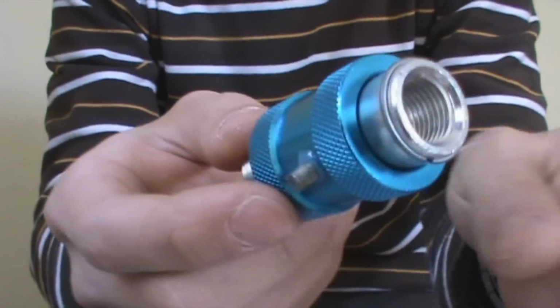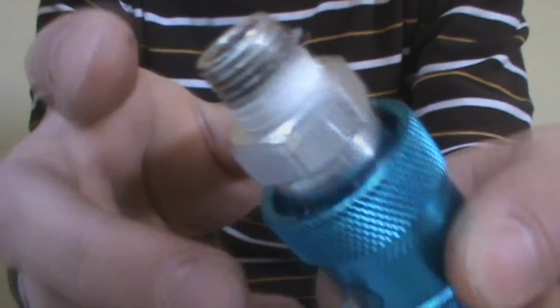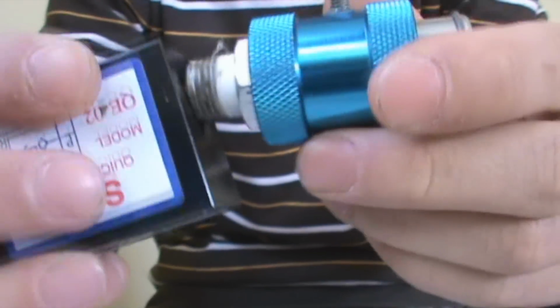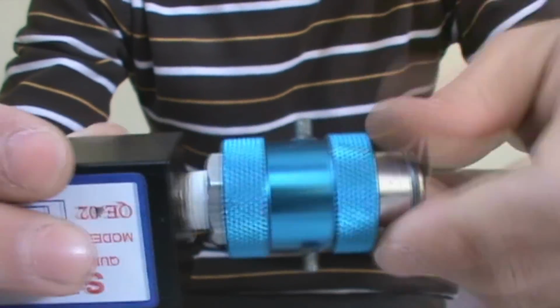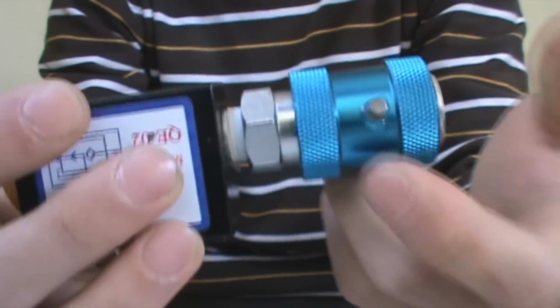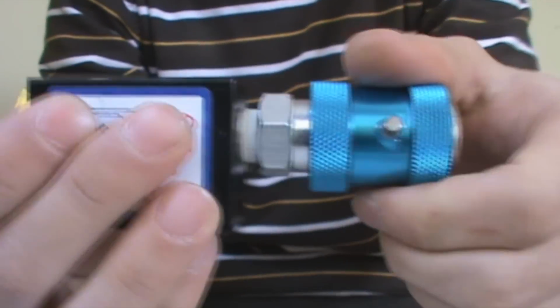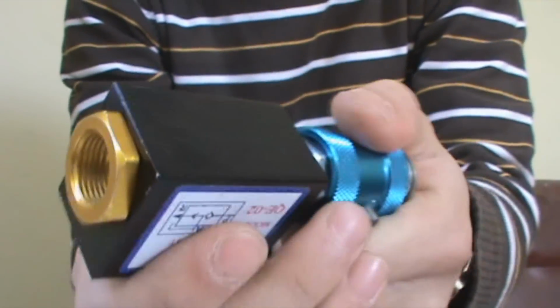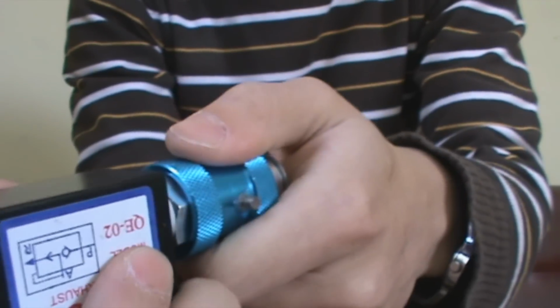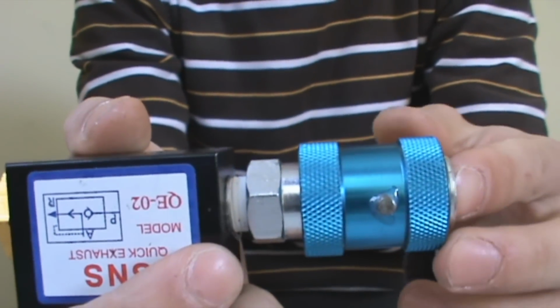A slide valve, you have to check, one has holes around it, that's the exhaust, which should go to the pilot port of your QEV. So what this slide valve does is it cuts off the air supply while piloting the QEV. So like this, it's charging the QEV chamber, and when you pull this back, it will fire the QEV and block the air input.